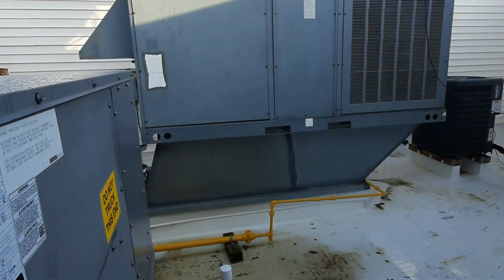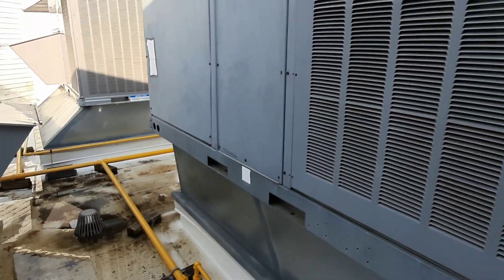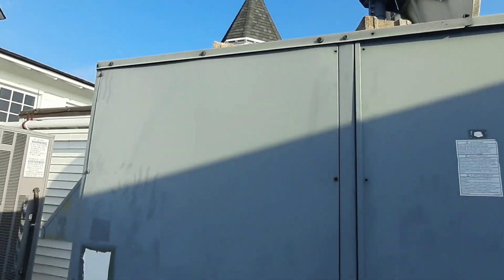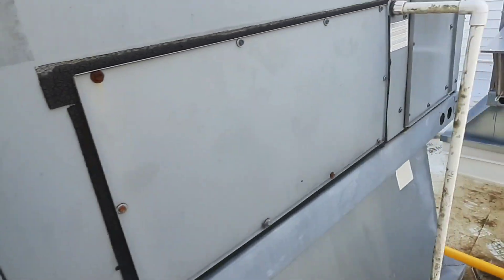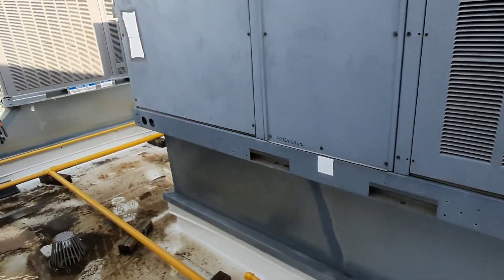They said it wasn't cooling well yesterday — I think it's going to be this one. We do have buildup on the coil, I can see it on the inside, so we might have a condenser fan problem too. I've got to figure out exactly which unit I'm working on. The call was: yesterday it started to get warm and muggy. This morning it's like 68 degrees outside and it's satisfied at 70. I've got a blower but no compressors — I've decided since I have a cooling call...